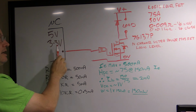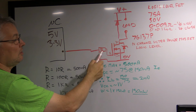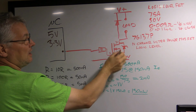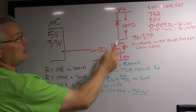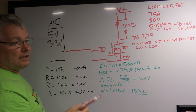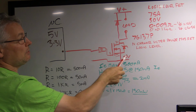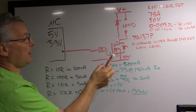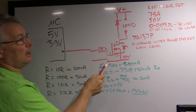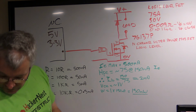So any microcontroller, like I said, Arduino Uno, a Texas Instruments LaunchPad, or anything like that, in this case you could put, like I said, a couple of 100 ohm resistor to the gate. This thing is just standing up. You load anything up to about 10 amps. It'll easily handle a 24 volt or 12 volt supply with a great big string of LEDs, or a reasonably sized servo or stepper motor and things like that. You could also drive other things from this, although you'd probably more likely get into some kind of bridge circuit and use P channel as well as N channel FET, which is different, I'll do that as a different video. But in this case, as far as how do you drive a high power load and have the minimal amount of components to do it, that's pretty much it. So anyway, that's all I have for that.